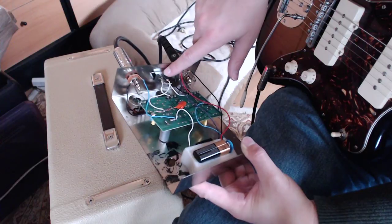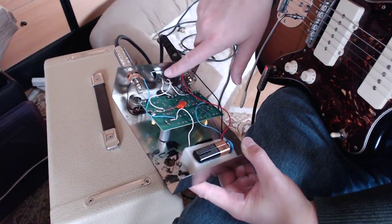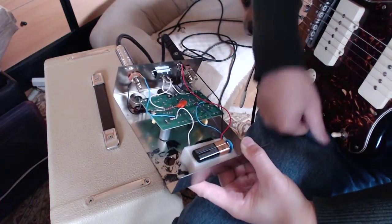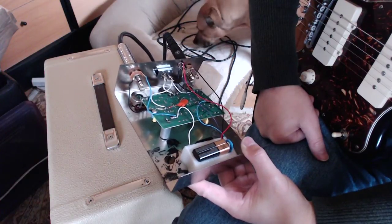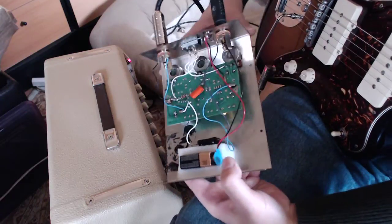the old parts, the metal tabs. And if you're very careful, you can lift up these metal tabs, take the switch or the pot apart, and you can actually get in there and clean out all that gunk. And I did that as well with the old pots here.